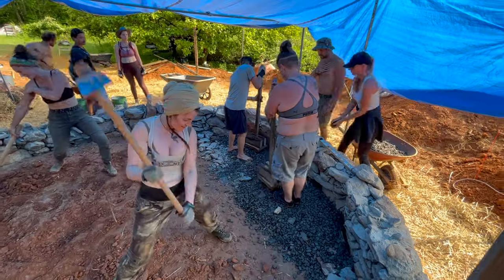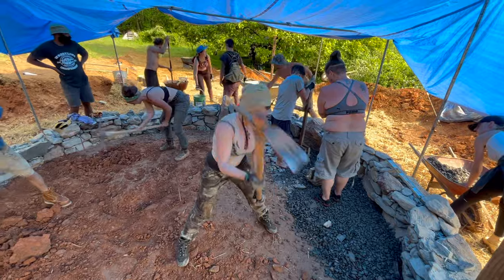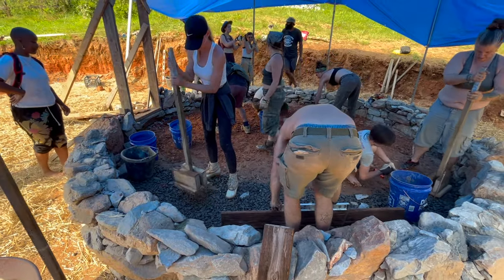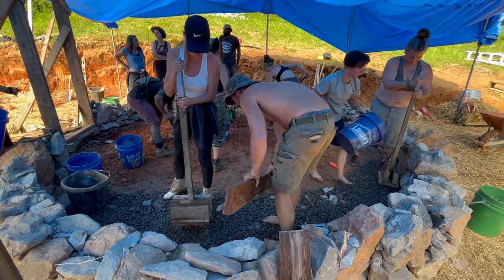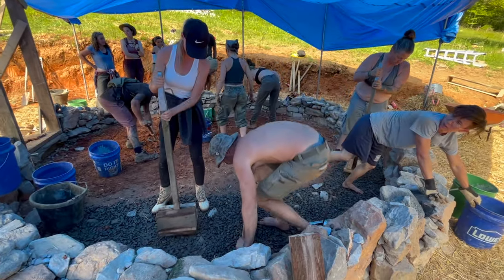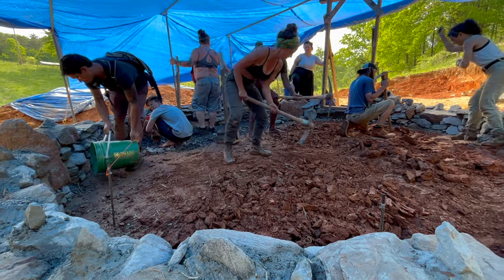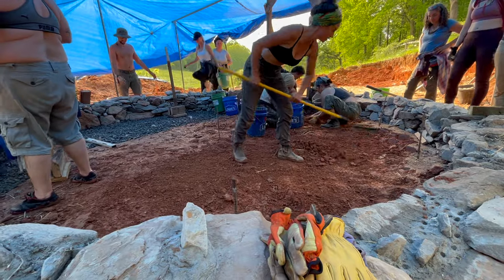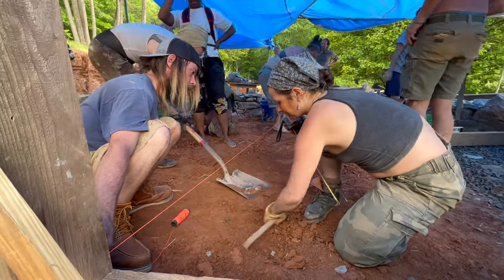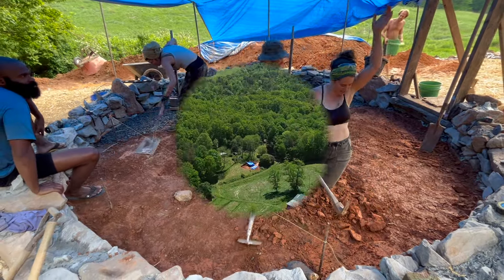It's important for the entire floor that you're building on sturdy ground, free of organic matter and topsoil. Something to also keep in mind is that for areas that need to be infilled, you will have a better result if you infill with solid stone as opposed to trying to raise the grade with loose soil. Similarly to our foundation, we don't want the floor to settle over time, which could lead to cracking. We continued digging, raking, measuring, and leveling, and this is where we were at as day 5 came to a close.